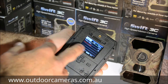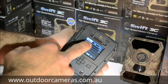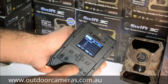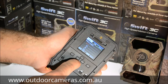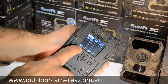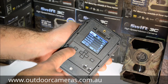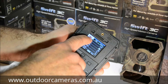Just to clarify navigation — you use these arrows to select things and the OK button to confirm. To change any setting, whatever is highlighted red, just hit OK. Use your up and down arrows to change the value, then hit OK to set it. The menu button with the M on it gets you back out. Video length was the last setting in the first menu.